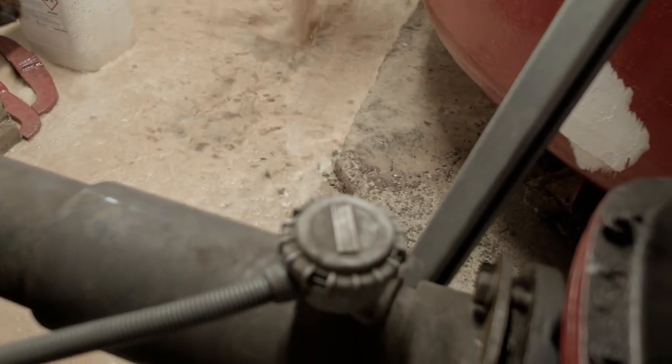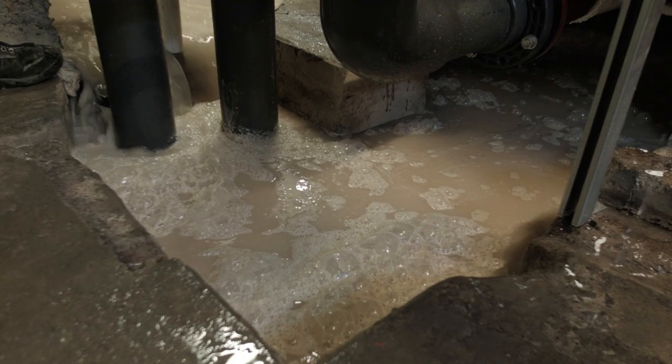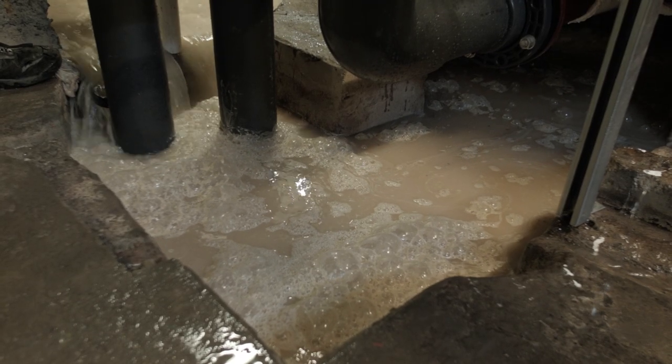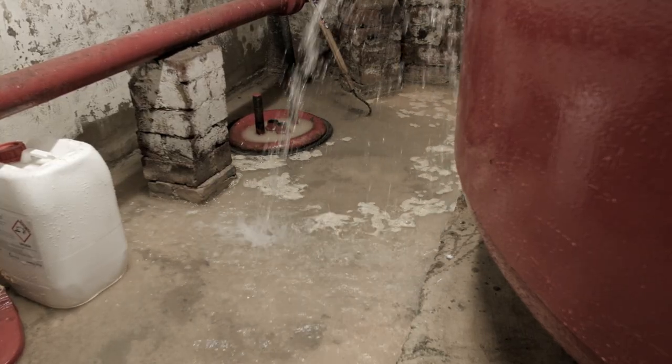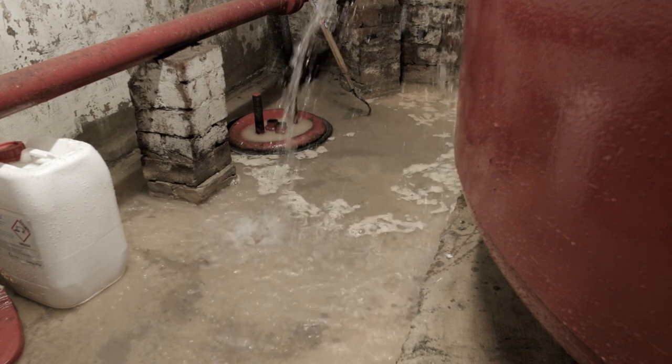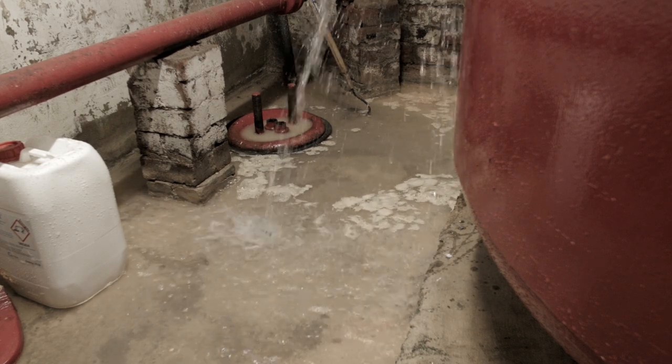When we're doing a backwash, we reverse the flow of water through the filter. So the water now comes in at the bottom of the filter and pushes up, and if you get it at the right flow, it lifts the dirt off the sand and we push it down to drain. This cleans up the sand, removing about 99.9% of the contamination within the sand. We don't get rid of everything during a backwash, but it gets rid of the vast majority, leaving us a nice clean filter to start back up again the following morning.